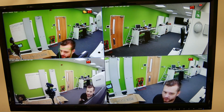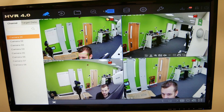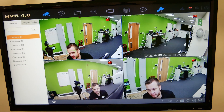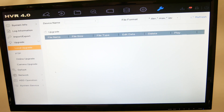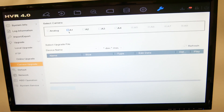Welcome back. We've put you in front of the DVR to guide you through the GUI settings. It's set up with GUI 4 so you can see the familiar interface. Under maintenance you can see the model number and current firmware — always make sure you update that via USB stick, FTP, online upgrade, or camera upgrade. Moving forward, I'm not going to go through the generic GUI functions as they're standard for the Hikvision range.